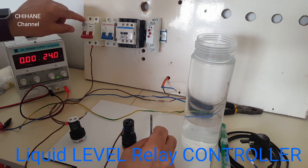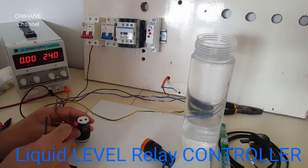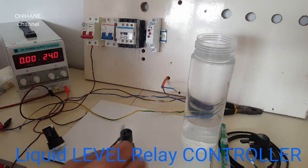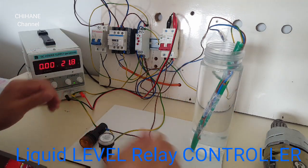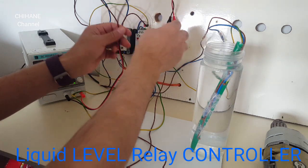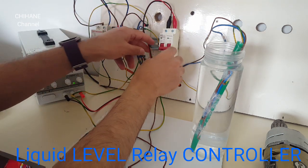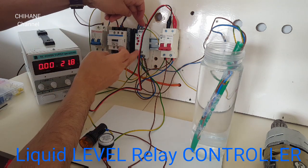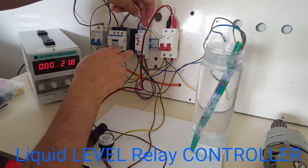From the DC circuit breaker to this light here, and from this light it goes to this other light. From the power supply — 24 volts — the positive and negative go to the circuit breaker. From the circuit breaker, the positive goes to A1 on the relay, and the negative goes to A2 on the relay.